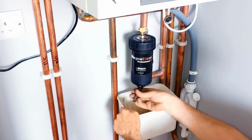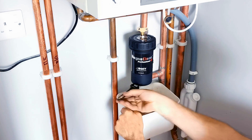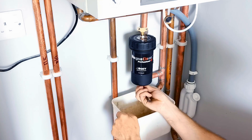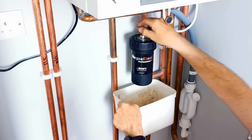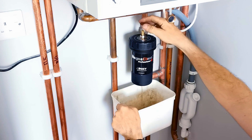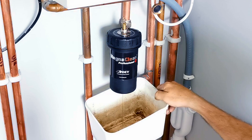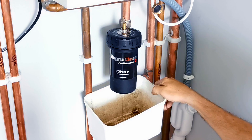There are several different ways of cleaning the MagnaClean. AD tell you to remove the plug in the bottom of the pot and drain it out completely, but I very rarely do this. When I spoke to some of my local engineer friends they tend not to do it either, because you don't really need to if you're just going to clean the MagnaClean by undoing the lid and removing the magnet assembly. You can see I've just undone the bleed screw on the top, which lets air in and the water runs out the bottom, gradually emptying it. I'd be interested to know how many people do drain it out — leave a message in the comments below.